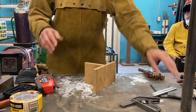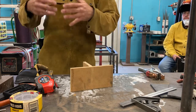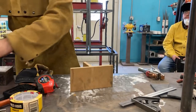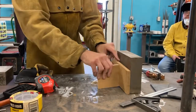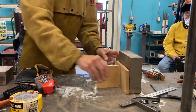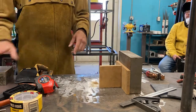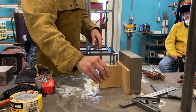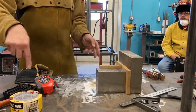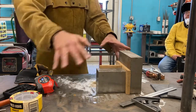And now I want to make this better. My parts will fall over, what am I gonna do? So now I'm going to introduce the next one, which is datum B. Each datum is at a right angle to the other one. Datum B holds this one in place, right here. Now it doesn't go anywhere. So this is B. Now what about this way? Let's introduce datum C. Another angle, and now look at my parts. All of my parts are held in 3 axes.